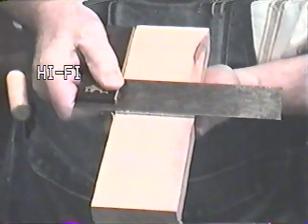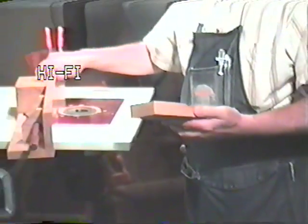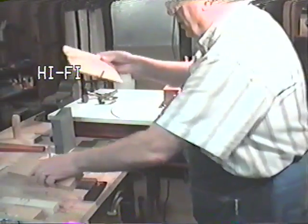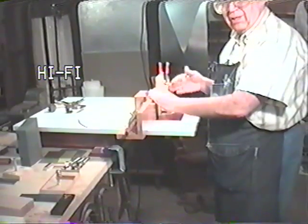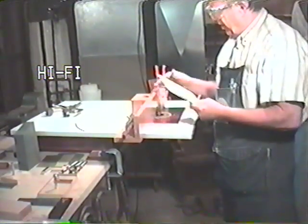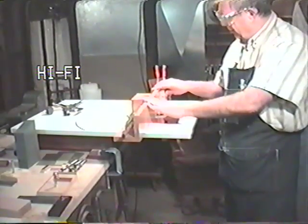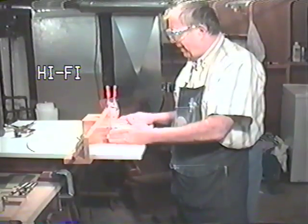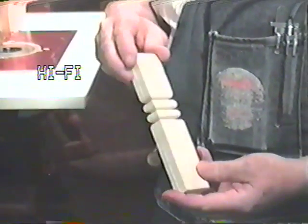As you can see, it is perpendicular to the edge of the board. So we can make some very interesting results from that. First of all, that means that if I take a jig — like this box jig — and attach it to the fence, I can cut box joints, and of course I could attach other jigs as well. It also means that if I wanted to cut a blind mortise that was larger than my bit, I could do that and move the fence without having to relocate any stop blocks. Further, I can cut rather interesting designs on legs or other pieces using this concept.